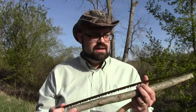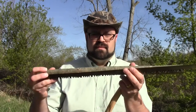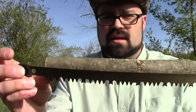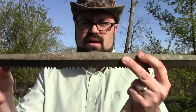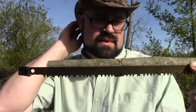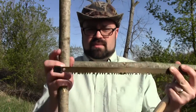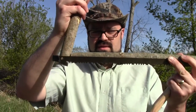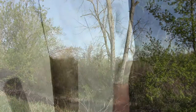Now with the middle section — the middle section needs to be a bit shorter than your blade, and I'll show you why in a little bit. You can see that my blade sticks out a little bit from those ends. The reason I do that is because when you put the buck saw together, you want the ends to be able to come in at an angle — this will keep the blade secure in the slots you're going to make.